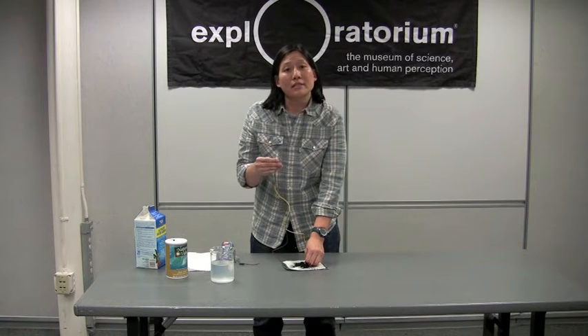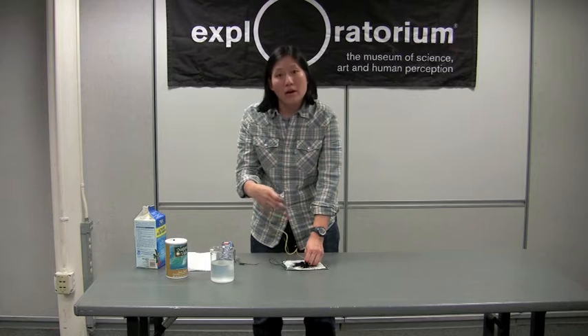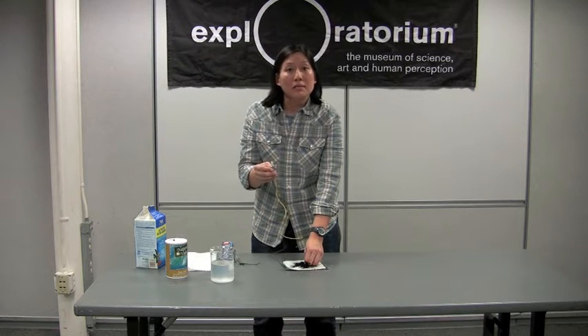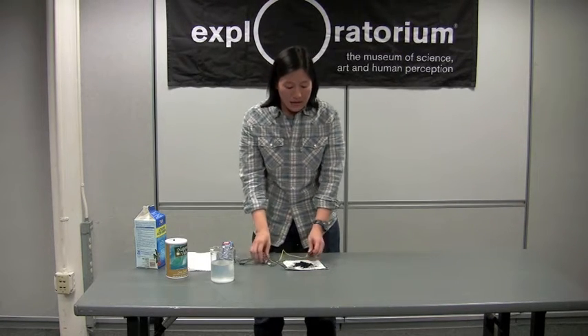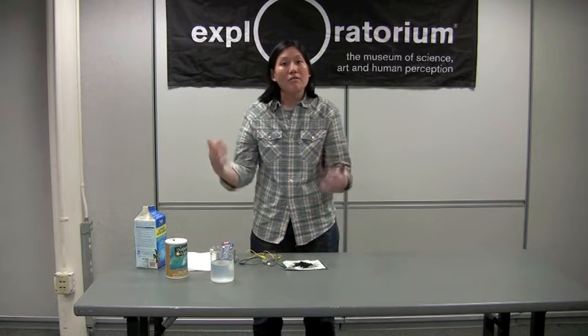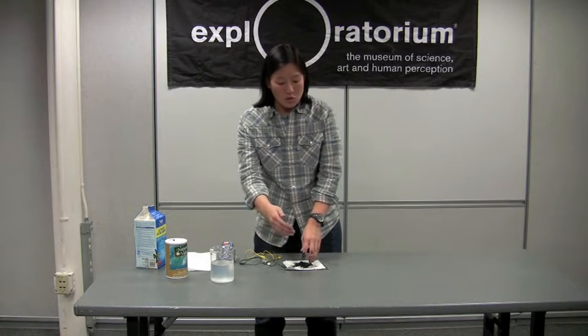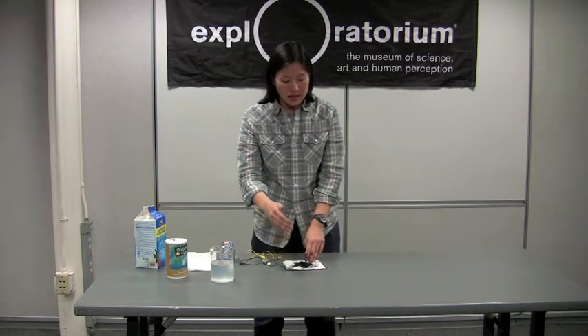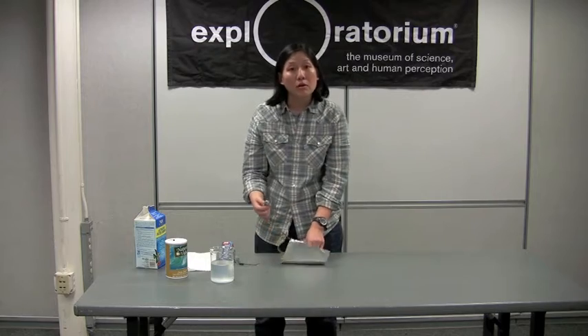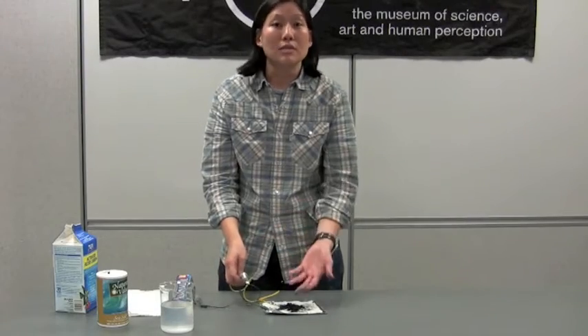You can see that the battery is now supplying electrical energy to the motor. What's happening is there's a chemical reaction with the aluminum foil and the salt water that's oxidizing the aluminum and creating electrons. The carbon provides a surface for air from the atmosphere to be reduced, which requires an electron. So one reaction makes electrons, the electrons pass through the motor, and they end up at the top of the charcoal where a reaction uses the electrons.